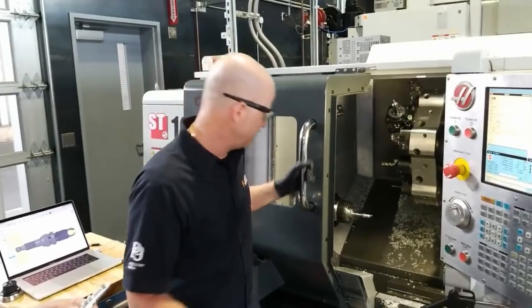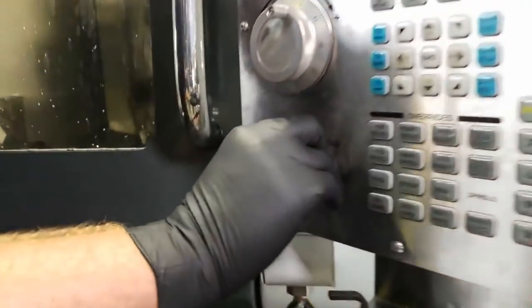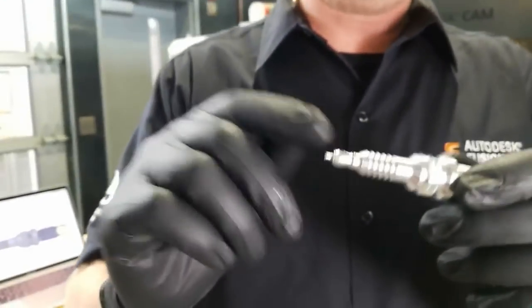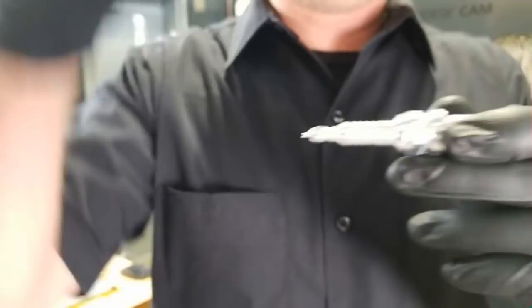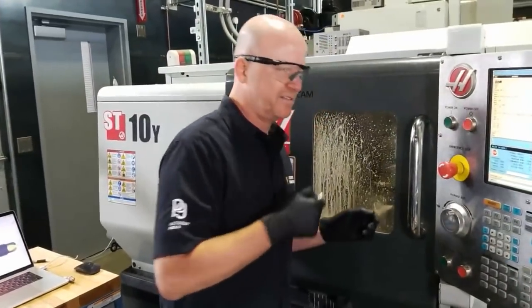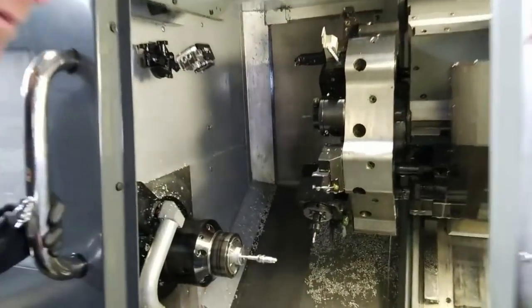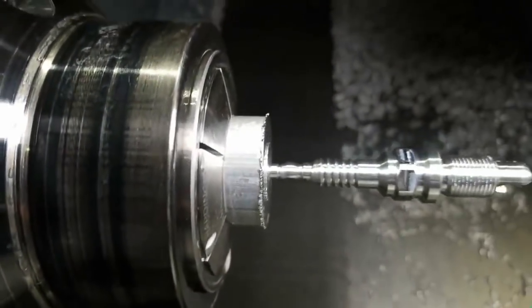So the next phase here is to machine the flats. We added the hole there on the end, and when Brad added that, we didn't put flats, but we decided to add some flats, so when the drill enters, it's starting on a flat face. That's what it just did. It just machined the flats. Not a whole lot to see, but you can kind of peek in there. It's hard to tell from the angle it's at.